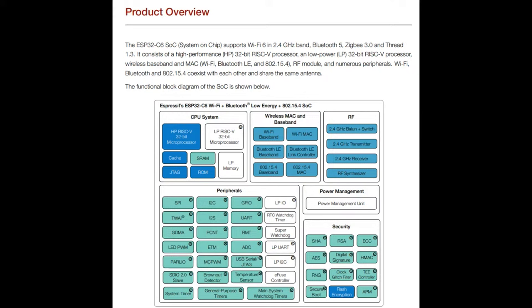Of course, the other new thing is an 802.15.4 radio module, which can do Zigbee, but also can do just straight packet-to-packet communication with 802.15.4. That's kind of interesting because all of this shares one antenna, which is really nice. It's all 2.4 GHz, all sharing one antenna. That's the hard part of the engineering, and they managed to do a really good job with it.